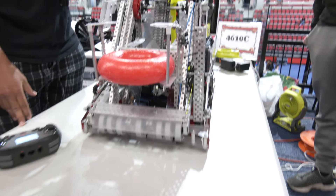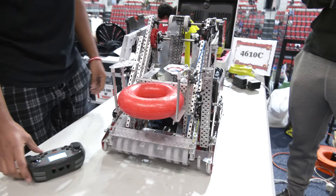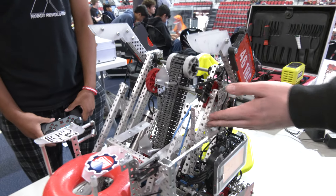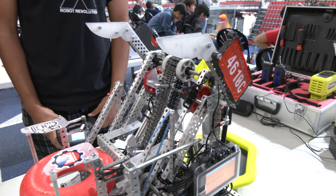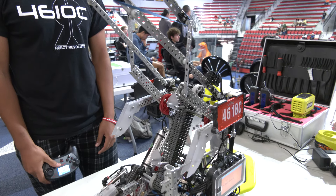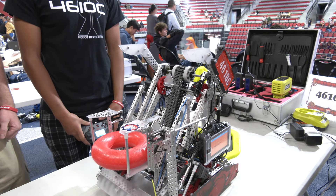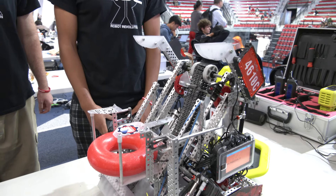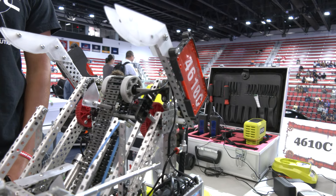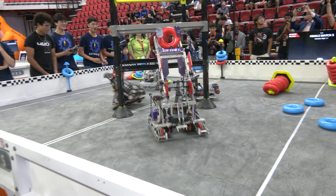Alex, let's talk about implementing a hang on your robot. When we first had it, it was connected to the left side — the issue was it rubbed against a bunch of stuff and took a lot more time. What we did was put it on some pistons, put some C channels and hooks on it. All I have to do is drive up slowly, get hooked up, and we're set. We have a tier one hang right now and it's been working pretty solidly.